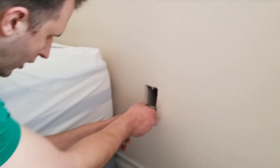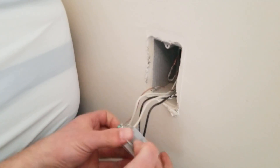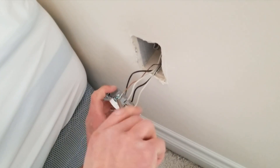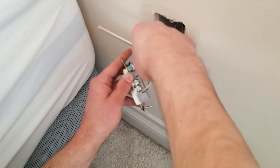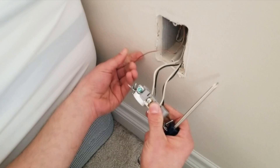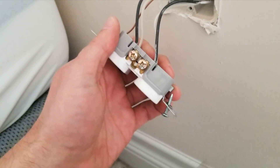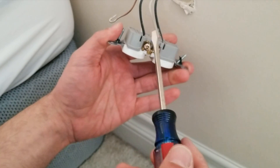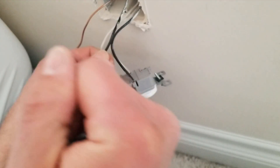Now you'll see the wires — pull them out. I take the ground wire off first, which makes it a little bit easier; that's just a simple screw. A lot of times different electricians have wired it differently. The easiest would be if the wires were around the screws, but since they're not, they have quick disconnects — so you have to take your common 3/16 inch screwdriver, wedge it into the release slot, and put a little bit of pressure on it and it'll pry right out.